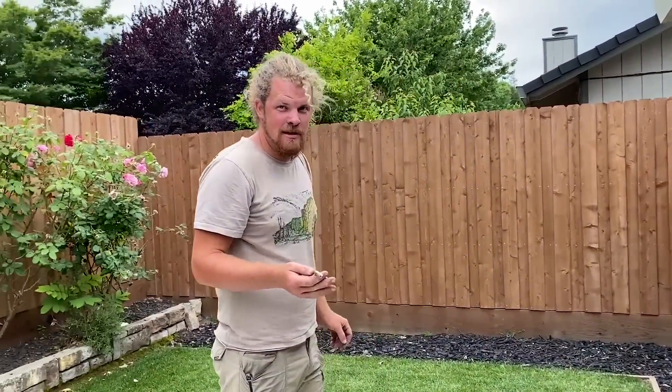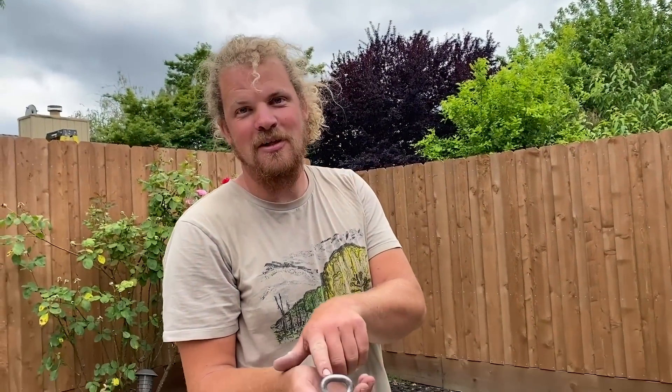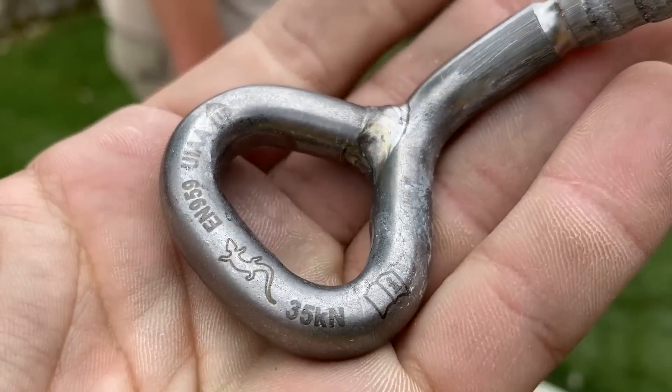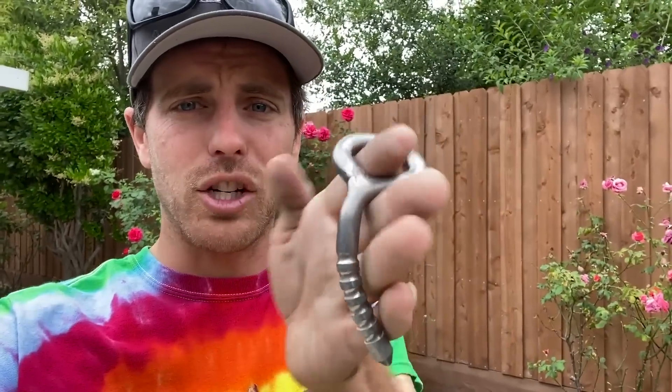Can we say that people need to chill out if bolts are being pulled sideways? Since all of these got above what's stated as the rated strength on the bolt, I'd say I'm not too concerned. Why would you pull a bolt sideways if you're a climber? Well, if you're a highliner and you put them in a cliff and want to take a highline in a different direction, there's been an aggressive discussion about don't pull sideways on bolts — which is, try not to. Try to put in bolts in a way that can be used in two different directions if you're trying to share an anchor, but it's not that bad.